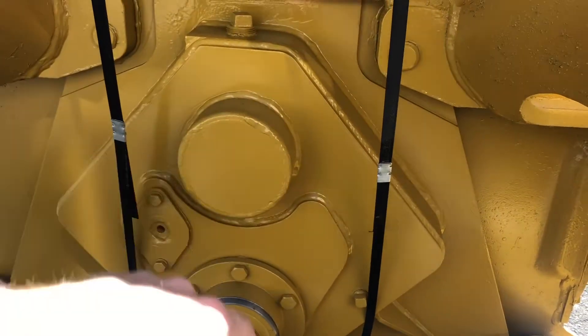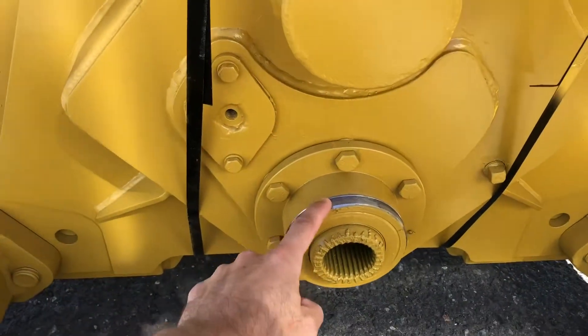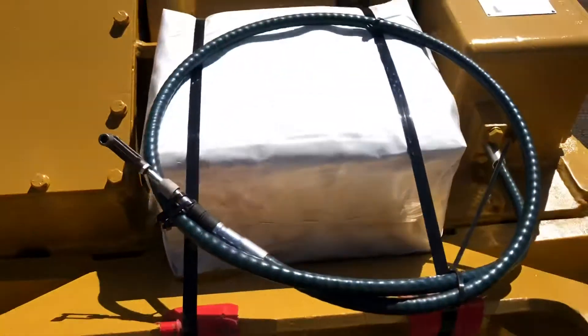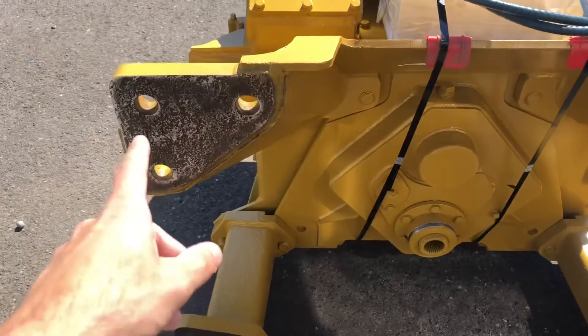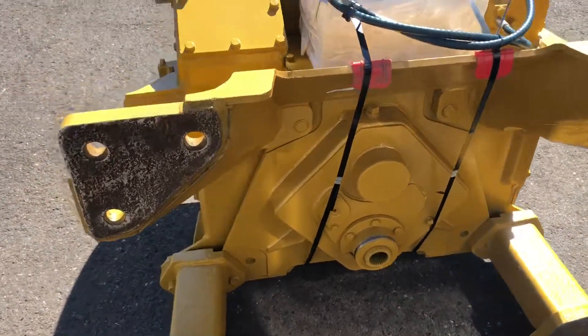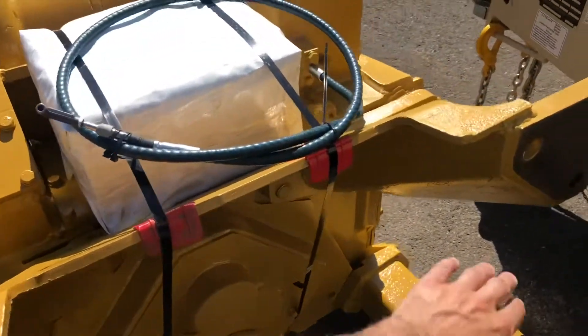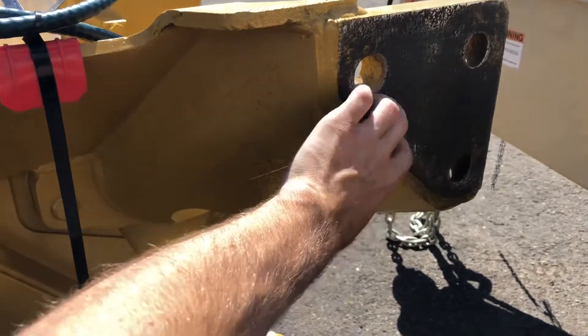You've seen them come in all full up. You've got an O-ring here, and then in this box you'll have the installation group — all of the mounting hardware, the studs, etc. When you mount it, don't leave any paint here. You want a metal to metal flush.